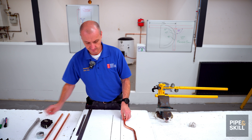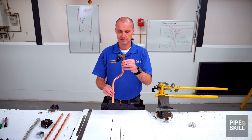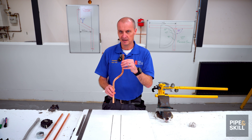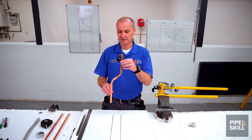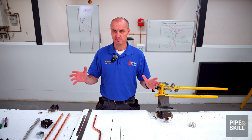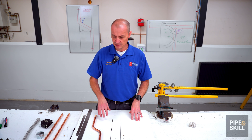What we're going to do today is bend it in one piece — a solid piece of copper pipe, no fittings — and we're going to do two, because most offsets are multiples of two, four, sixes and eights. The way I'm going to show you means you've got something to reference back on, so if you've got a bank of eight or ten pipes you can do every single one at the same angle and the same size so they look really nice when fitted.